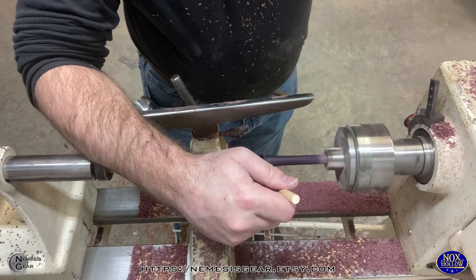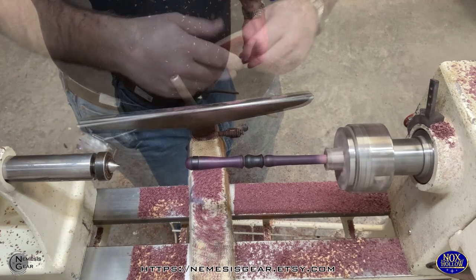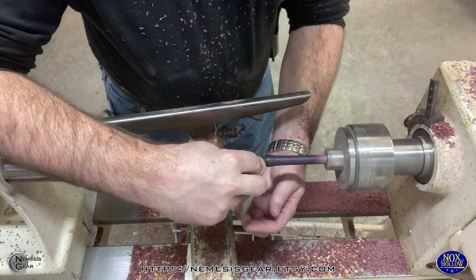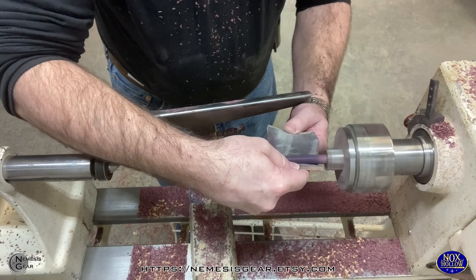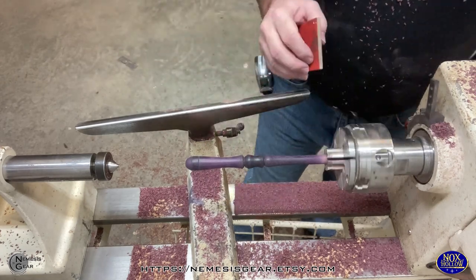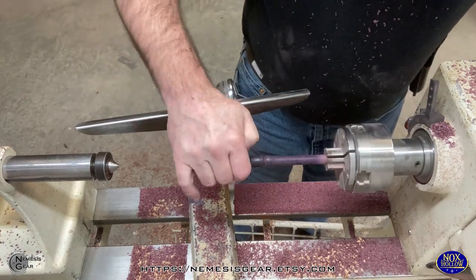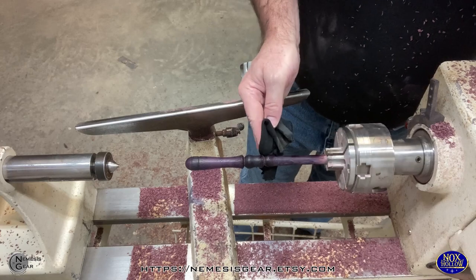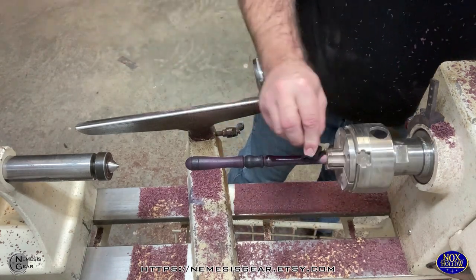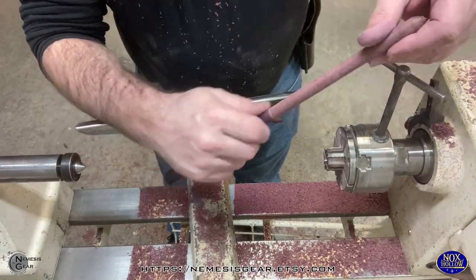Because it works so quickly, it's harder to control exactly where to stop. I did put a little bit of ebonizing fluid on a couple of spots just to make sure it was nice and dark. Once I get the oil finish on here too, it does kind of darken and clean up. I'll show you the oiled finished wands at the end in the final photo. I'll wipe this down with some denatured alcohol to clean the dust off and give you a general idea of what it looks like, then taper the shaft and get that sanded out before the oil.